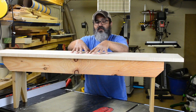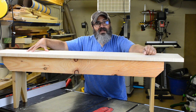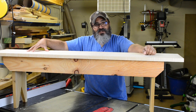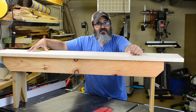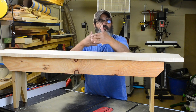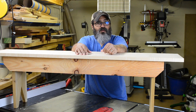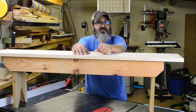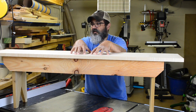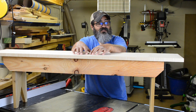It's a really super simple project that was made even easier by using a very non-complex joinery — the butt joint. While it was taken one level up because we used pocket hole joinery, it's still as basic and simple as you can possibly get. The nice thing with pocket hole joinery is it will help minimize the effects of wood movement, because given that we're using three different species of wood, there might be a little bit more wood movement overall. But with where we placed those pocket hole joints, I don't think we're going to have a significant issue. In fact, as I'm recording this, this has been in our bedroom now well over a year, and we definitely have humidity swings here in Michigan — and there have been zero issues.